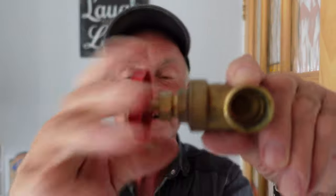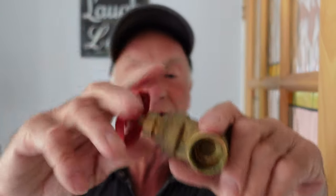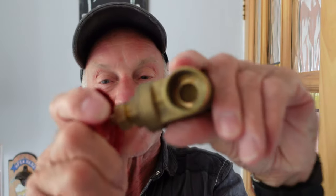One last thing — when they are right off, a lot of times they don't go quite fully off because the gate doesn't quite shut; it might be sitting on a piece of swarf or something. So it just lets a little water by. Especially with old gate valves, it's quite normal to turn the thing off, open the hot tap, and find it's still running a little bit — not as fast as before, but just enough to stop you from working on whatever plumbing job you wanted to do.